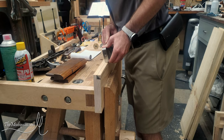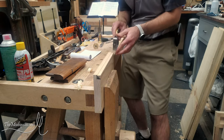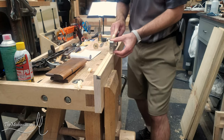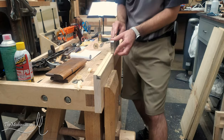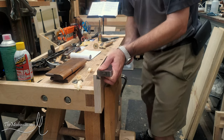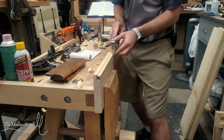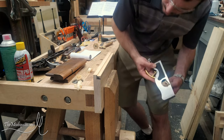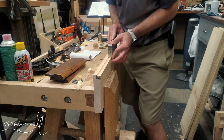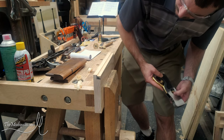You can kind of see it's tipped up on its corner. I had a marking gauge line there. You start with the very corner of the shoulder plane and then rock it down into the cut until you get it flat. Sometimes you may have to go back with the shoulder plane on its side to clean up that back edge. I adjusted the iron a little bit to the side because it wasn't quite where it needed to be.